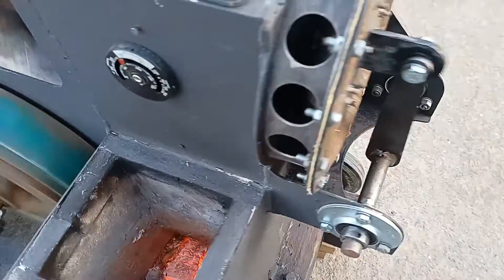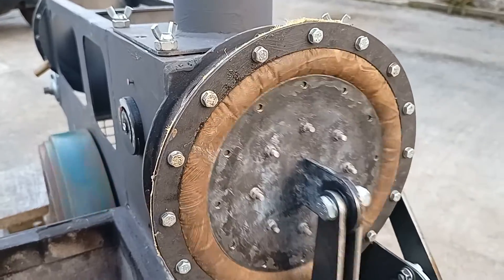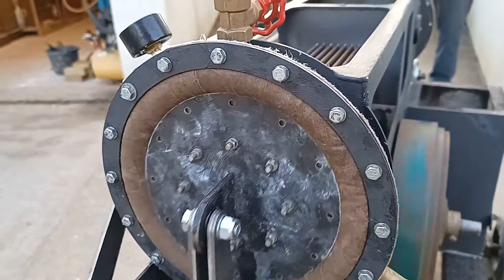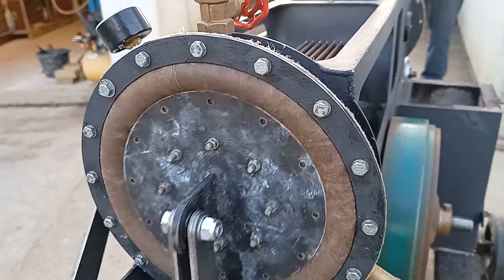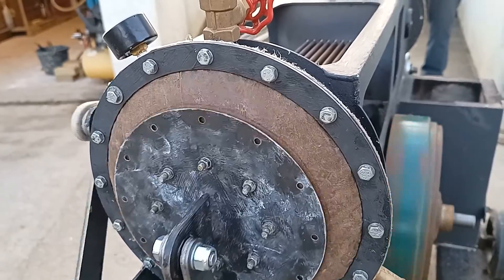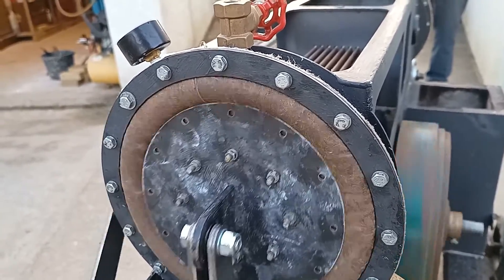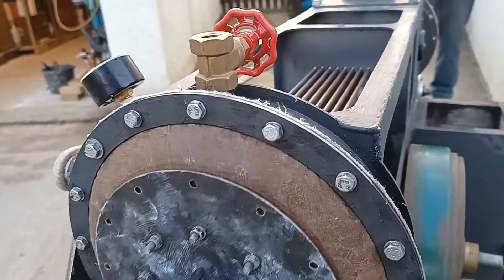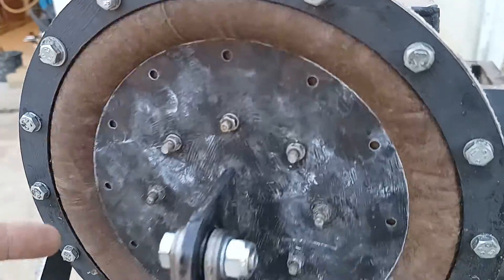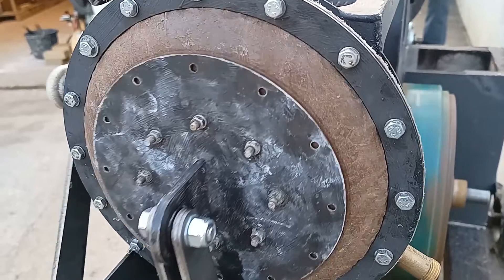The fire is dying down. The seals are still intact, which is a nice thing — this is a Teflon seal on this side and a cotton seal on this side. I did my best to get them as tight as possible on the in-stroke, but they're still a bit puffy which might be robbing some power. I do wonder whether I can make some kind of ring at the correct angle to go around the hot and cold side — that might be something for the future.